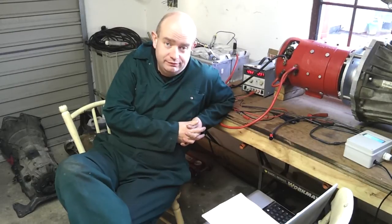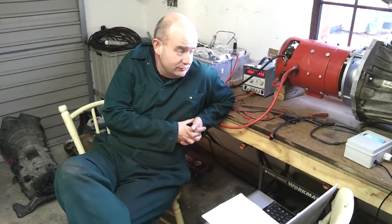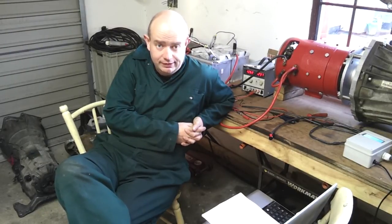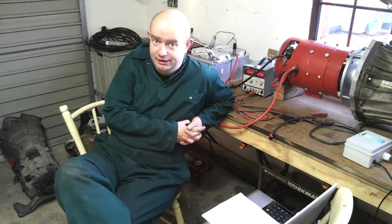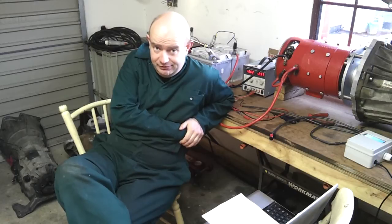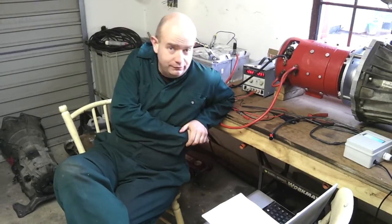And we would definitely have had components flying out the side of the gearbox casing if this had been driven hard. Several of the gear selections caused the gearbox to completely lock up. Just a torque converter slipping was the only thing that basically saved us from ringing something off here. That and the fact that those two car batteries probably couldn't light a friggin' LED at this stage, but again, that's kind of why I'm not using a big string of CALB grey cells, in that if a load does come on this thing, I want it to kind of bog down. I don't want it to twist something off on me.